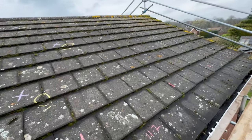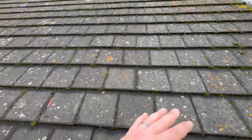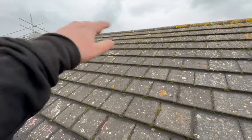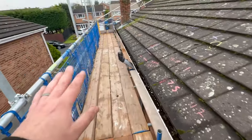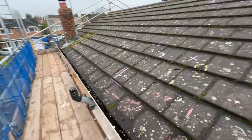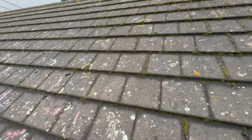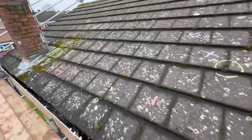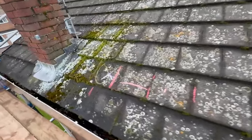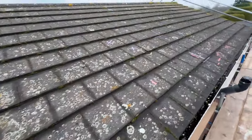Welcome back. This is another job and we are on the south-east array here. I'm going to give you a quick look at the roof — we're doing both sides, you can see Mattie and Nathan are on the other side. Full scaffold screen so we're nice and safe, a really clean deck that the scaffolders have put up. You can see we've been over the roof and marked out problems — broken tiles with corners chipped off. This is before we've started. We do this on every job — get your pictures, run through with a video, so you can show the customer that there's damage up there and a bit of repair work is needed.